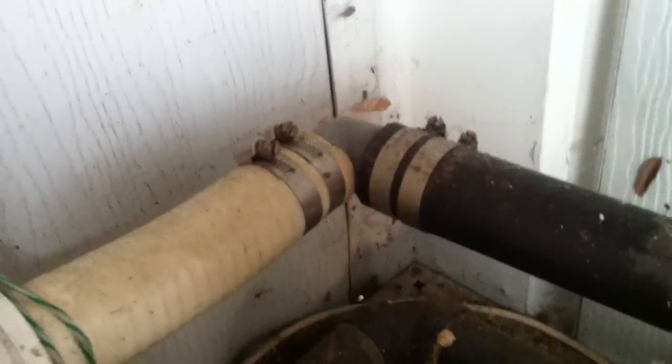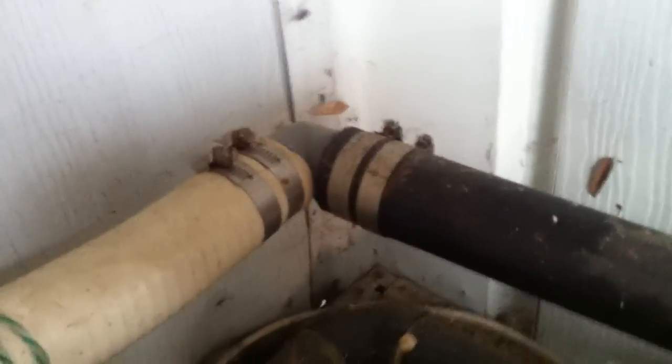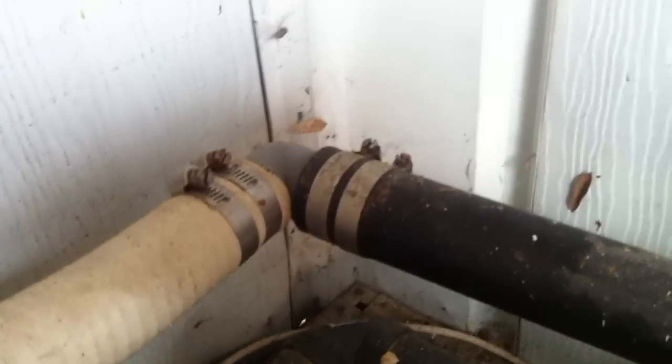The lines in and out of the heat pump — we still have ABS everywhere. The return line on top is ABS. I've never even seen someone try clamping rigid pipe before — that is never going to work. It's not leaking currently, but it's a matter of time; this is a guaranteed failure. Someone needs to come in here, rip this entire system out, and replumb it properly. This is one of the worst I've seen.